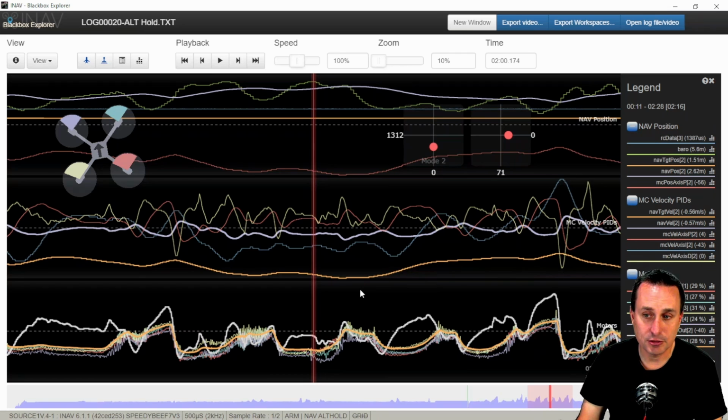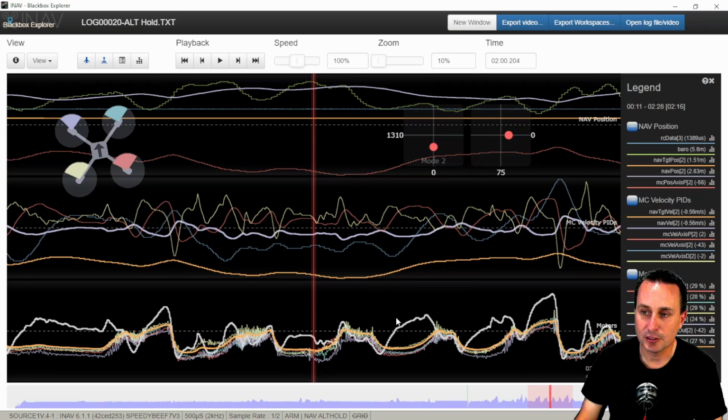And then the D term, and you tune those just like a normal PID controller, which we will have in a detailed separate video coming up. We're going to go through all that with a quad in detail, but I wanted to get this one out so you at least know what I'm talking about and all these little nuances with iNAV Altitude Hold.